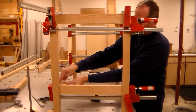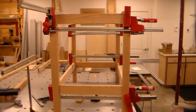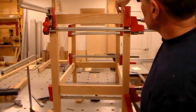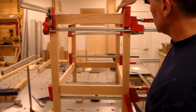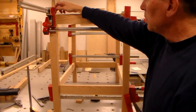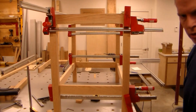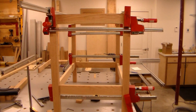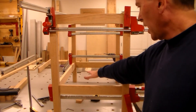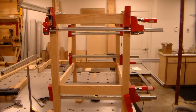You won't see that line wrapping around as you look down. The tops are just a shade high, and that's fine — I'll hit them with a hand plane and bring them right into true. I'd rather they be slightly high than low; this way I can get them perfect. So far so good, it looks good. I've got to get the top and the other parts done. This part is going to be black, the field here will be stained, and the top will be stained to match a couple of other tables I made for her.